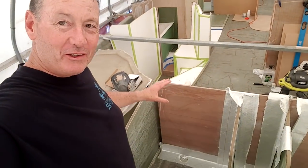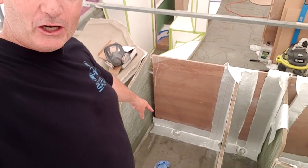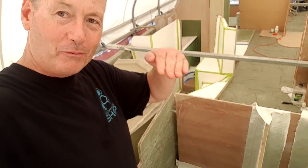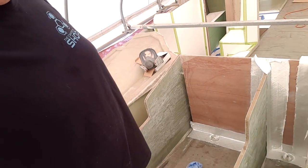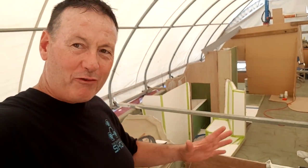So I'm all set up in the bow. I've basically got a lot of tabbing to do. You can see here I've laid out my cloth and pleated around where these drain holes are — these are individual compound curves, quite a challenge. I'm sitting on about a 45-degree angle because this is where the bridge deck rises up and goes up to the bow. It's about two in the afternoon, I anticipate getting about three of these done today, but man it's so humid — about 75% humidity and going up.